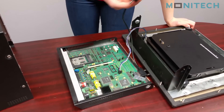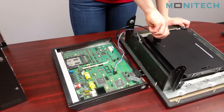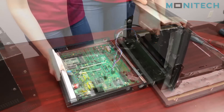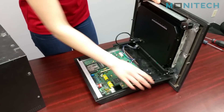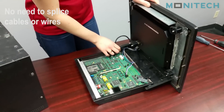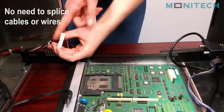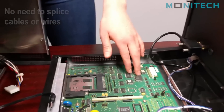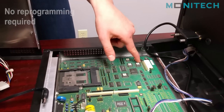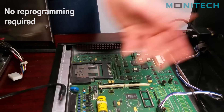Now you're going to plug your video cable into the monitor and make sure it's secure so you have a good video signal. From there you're going to assemble it all together. Plug the power source — which has pin 1 marked on the top if you look very closely — into the control board, which also has pin 1 marked on the board itself. Then you can plug the power into the monitor.